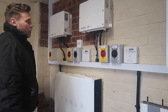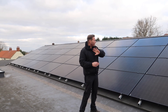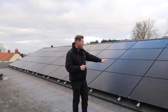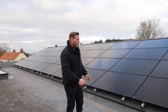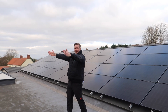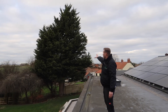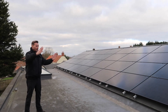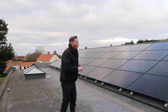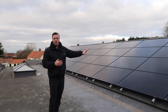A quick run-through of the components installed and why. First, we've got 44 landscape-installed Jinko Tiger Neo 435-watt all-black panels — beautiful looking panels, really slick along this roof. It was a great roof to work on: a nice pitch of about 25 degrees and virtually directly south-facing. The only issue is trees on either side which will cast some shading on the panels. The customer is considering taking the trees down or cropping them, but for now we had to factor that into the design process.